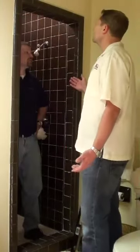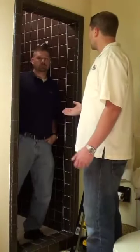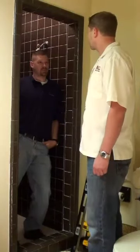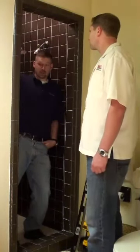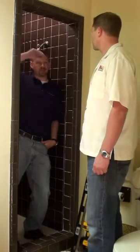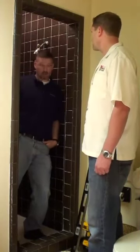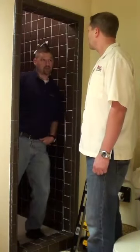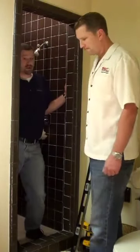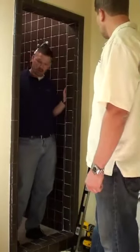The customer had a choice on door height. We chose a door a little bit shorter, but if they wanted a steam shower — and a lot of folks are going to steam showers — they can run that door all the way to the ceiling. If you're not doing a steam shower, you always want to leave a few inches up top for air exchange, because it'll help cut down on mold and mildew by allowing dry air to come in and moisture to evaporate out.